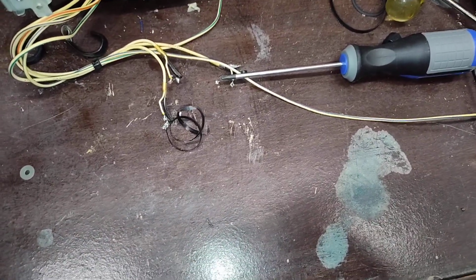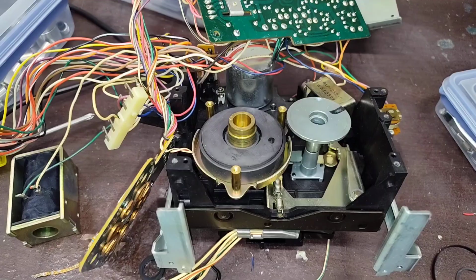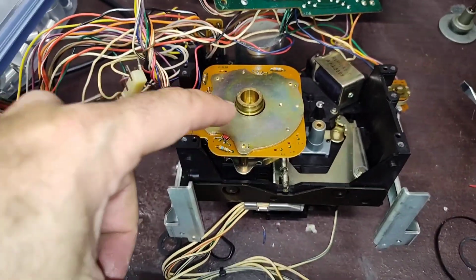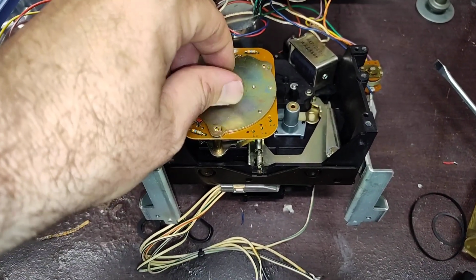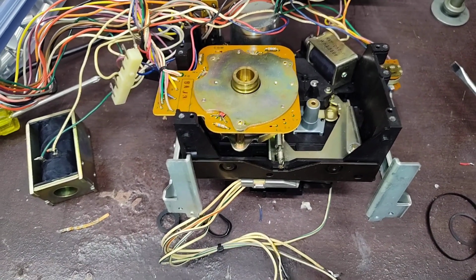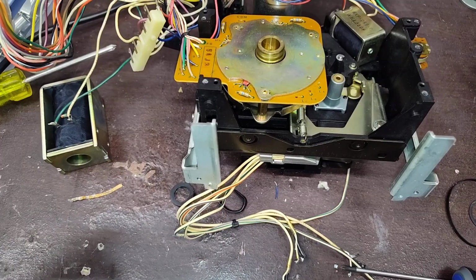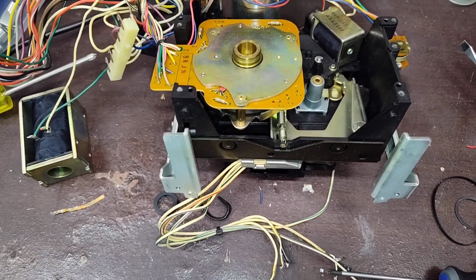Oh, I know why. I forgot the thrust bearing. Duh! Hold on a second. So when you put the direct drive backing plate back on here with the coils, the magnetic force pulls up on it and floats it here, and then you have to reapply the thrust bearing, and the thrust bearing will keep it happy.